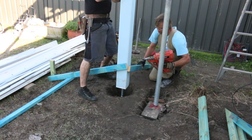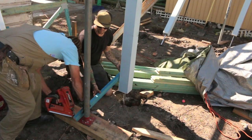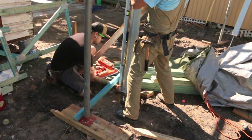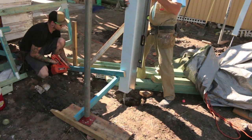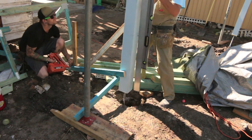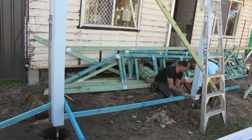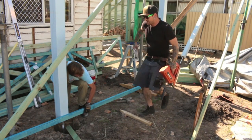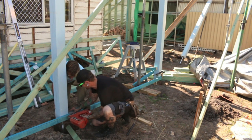This is how you get your posts to line up beautifully each and every time. The trick is to get the posts at either end of your beam set up nice and plumb — absolutely dead plumb. To do that, just attach a brace to the bottom of the post back to a picket that you've banged into the ground. Once the post is plumb, nail it off. With that done, the rest is child's play — just attach a length of timber between the posts with the post spacing marked on it, line up the post spacing, and nail that off.